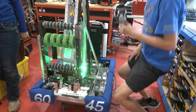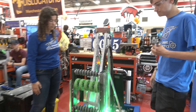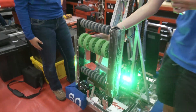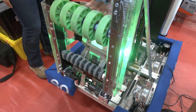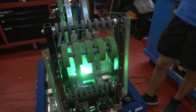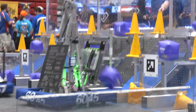With the two-pivot arm, we can reach any point on the field very quickly. As for the intake, we went very heavy on the EveryBot style. The big change we made to the EveryBot-style intake was we stuck to four-inch wheels rather than three sets of two-inch wheels. This really lets us work with the cubes really well — I think that's easily our strong suit for this robot. And it really is; this one small change is really what led to all of our success, just because of how much simpler it makes picking up cubes off the ground.